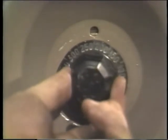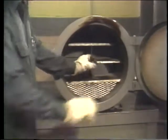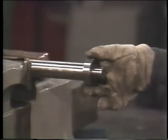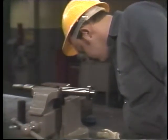An air oven's a lot like the oven in a kitchen stove. It's thermostatically controlled to maintain a certain temperature. The oven can probably give out more heat than the bearing can stand, so it's important to set the control properly. Otherwise, the heat could damage the bearing. For example, it could burn up all the lubricant in it. When the bearing has reached the proper temperature, take it out of the oven and put it on the shaft. After it's cooled down, check it for position as usual.